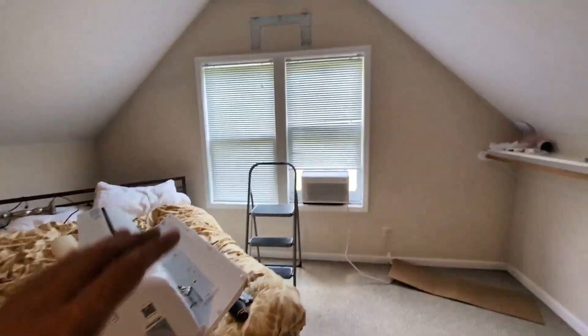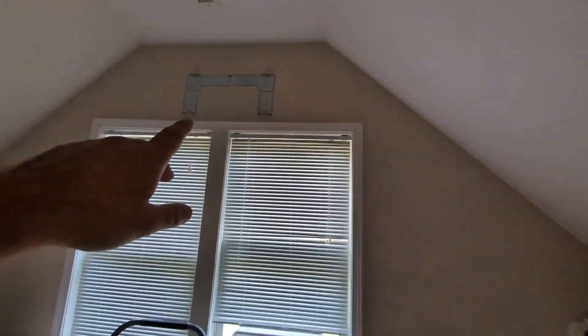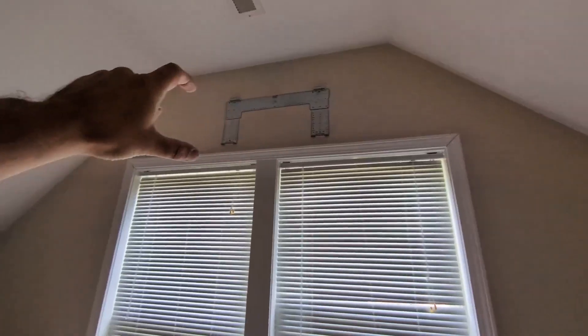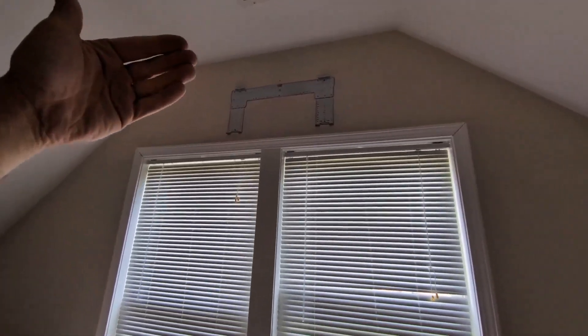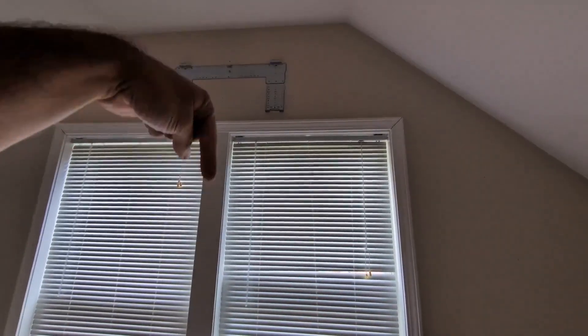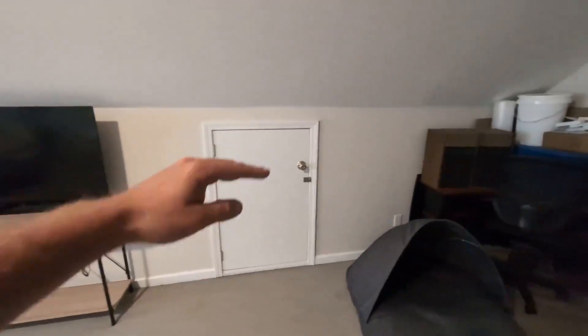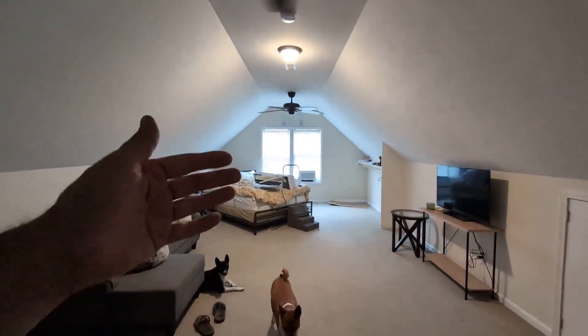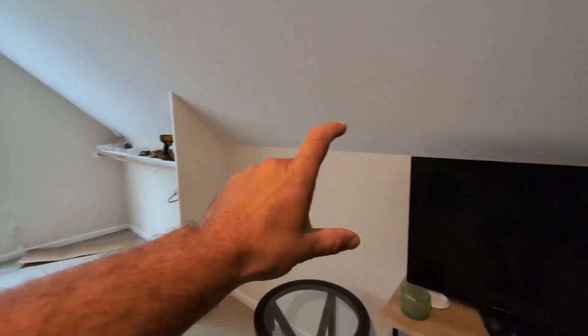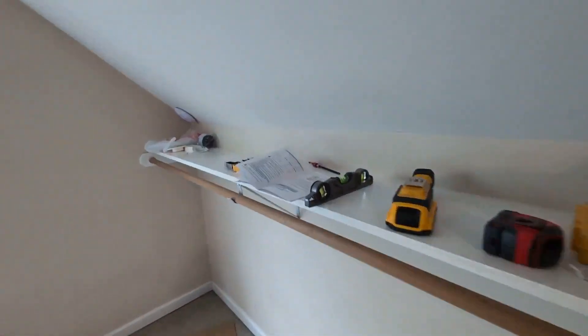There was a secondary complication. My original spot to hang it was here, but I realized that this is a load-bearing end wall, and that window has what's called a header. You have a thick piece of wood across the top and that is structural, so you should not alter that piece. Drilling through that to put the line set down and outside became not an option. I looked at some other walls in the room, but the unit would be very low on the wall, and for circulation and ventilation, this is the best wall.